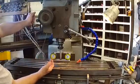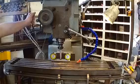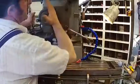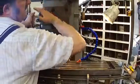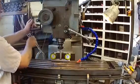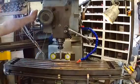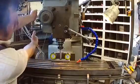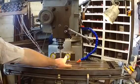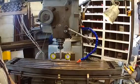As you can see now, that's about where we were — we're at a thou out. So if I put that one on zero, we're about five thou out now. What we're doing is we're going to tip this end in this axis. If I move it about halfway — it's not too far. So we're watching for both needles now to come to zero. There's zero there and zero there, nice and steady — and that's bang on zero.